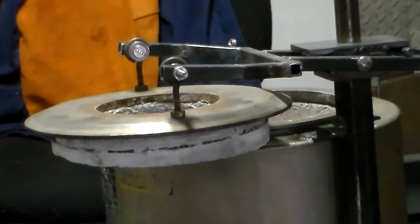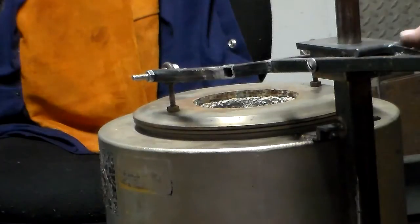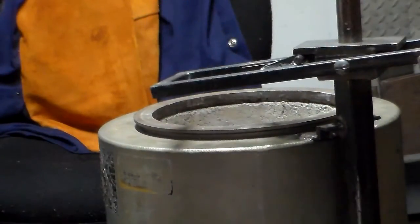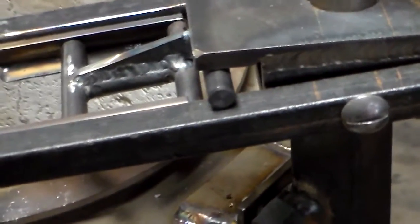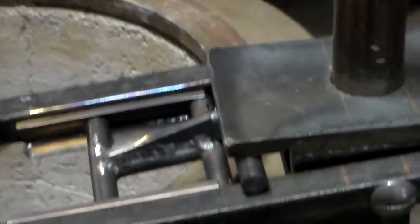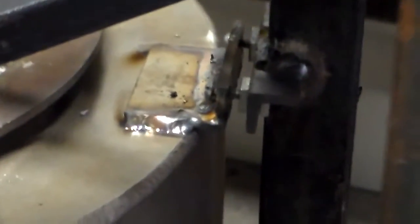I got the latch figured out. Let me get you in closer so you can see what I did. I welded up three sections of 5/16th rod — four sections actually — in a little wedge shape, and welded in little channels on the rails to act as guides. I also figured out how to control the spacing and welded up some stainless.